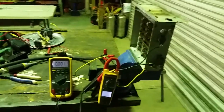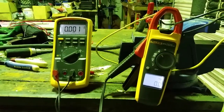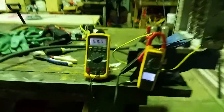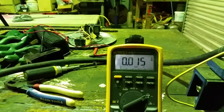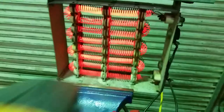It's my little experiment here with the heat strips. I've got two meters, one on each leg, going to my welder outlet on a 50-amp breaker. Got my fire extinguisher ready. Let's see what happens when I cut it on — pulling 20 amps on that leg, 18 on that one. Gets hot pretty fast.